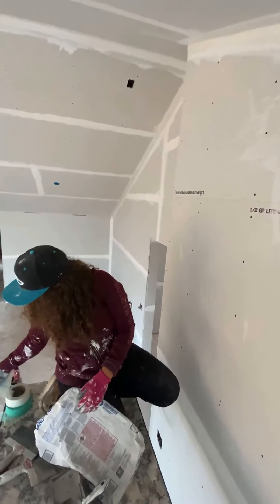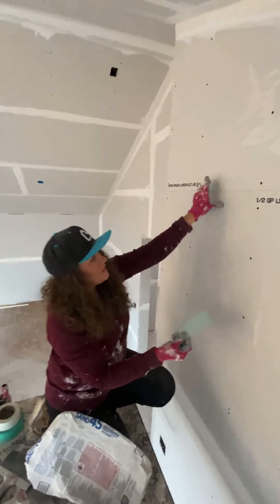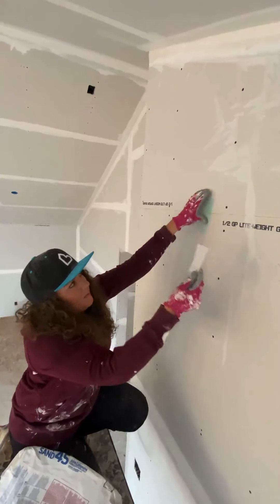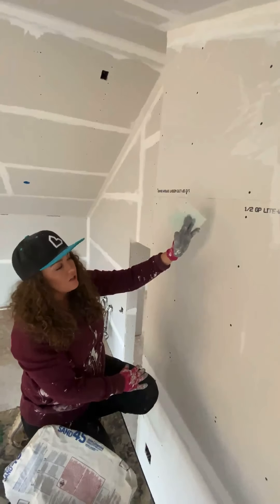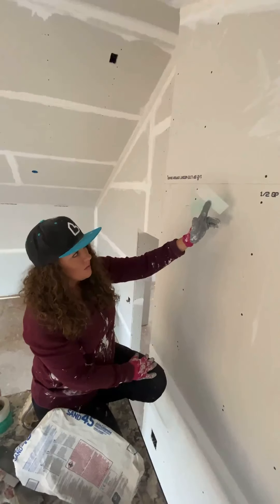Products that can be applied with hot mud would be sticky tapes. This is mesh tape and it will stick all by itself, so you don't need any mud behind it to get it to stick. But something really important about these tapes — they're fiberglass — is that you use hot mud with them. If you don't, you're going to have cracking and issues because they need the strength that comes from the hot mud to make sure they work.